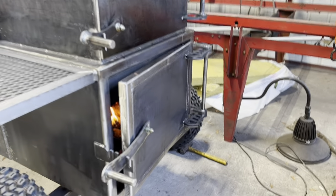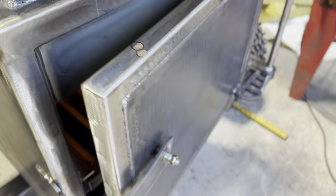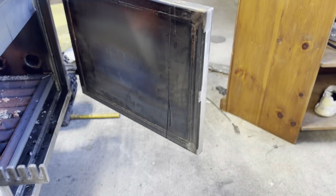This firebox is 30 inches wide. This door right here is double wall quarter-inch with about one and a half inch tubing and insulation between. This door probably weighs about 150 pounds by itself, and it does not sag at all.